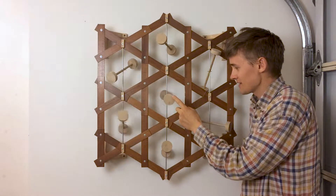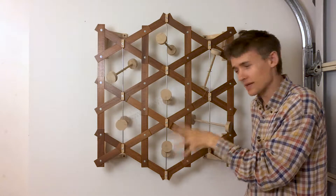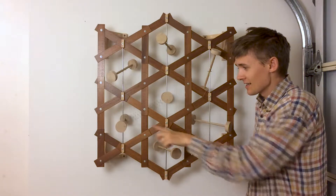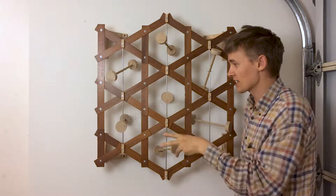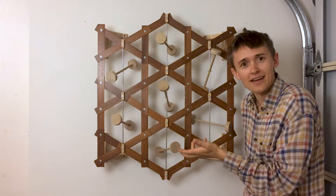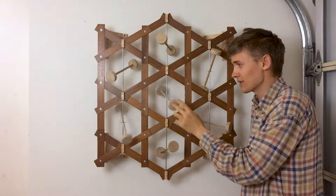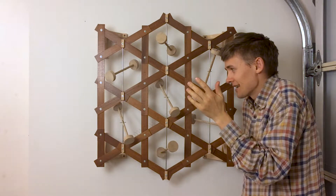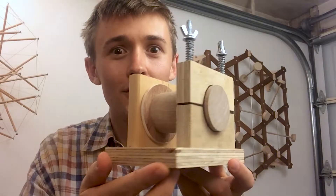But these rods influence each other perpendicular to the spring, and in any direction. One of the reasons I chose this triangular lattice to begin with was thinking that because there's more connections, the wave is going to be more omnidirectional. Looking at this now, it occurs to me maybe I could have gotten away with a square lattice — they have this nice leader-follower relationship. But I guess I'm already locked into the triangular lattice. So now I've got to fabricate a whole bunch of these springs, and to make it happen, I've built a special device: the friction spool.